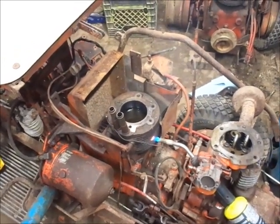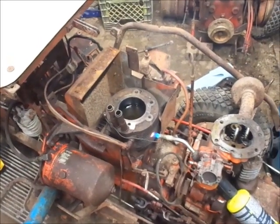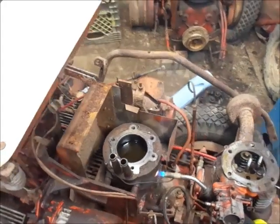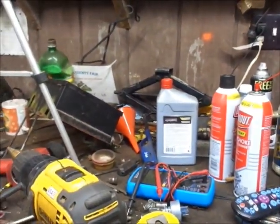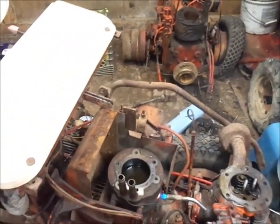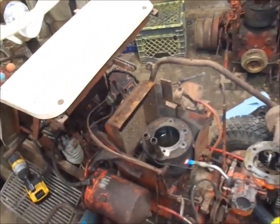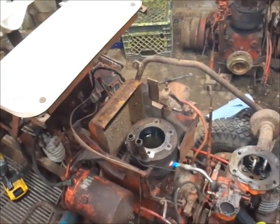It's been about a week and the motors are still helplessly stuck. I'm going to heat this one up and hopefully get the PB Blaster to evaporate out of it, then switch and put some ATF — automatic transmission fluid — in it. We'll see what that does. While it's warming up, I'll keep some pressure on it; maybe it'll pop. I kind of doubt it, but one can hope.